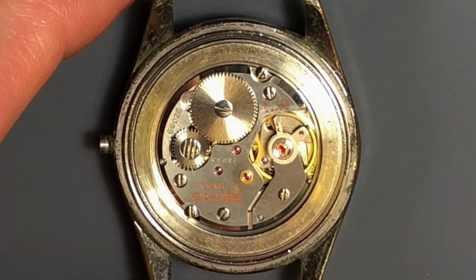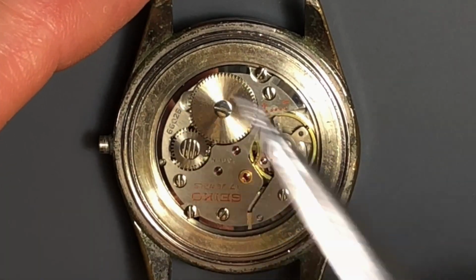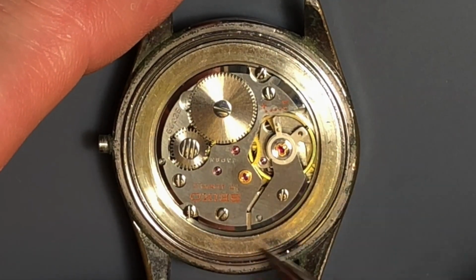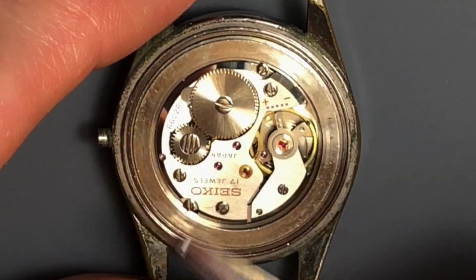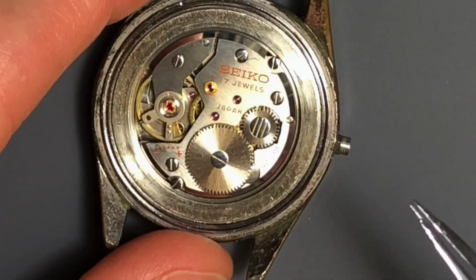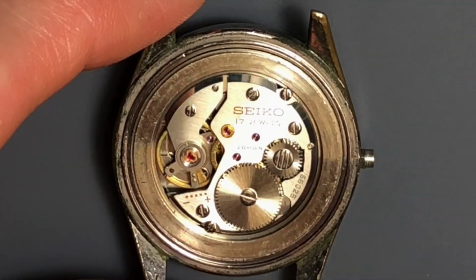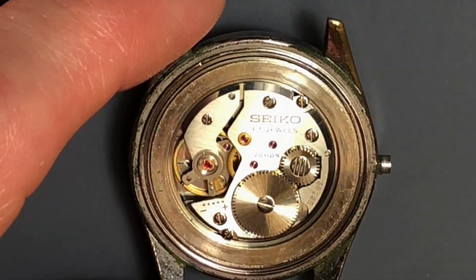And in fact, if you checked out the last watches that we had on offer, I had a little gold salesman sample tank that was sort of the base movement of this one, a 66. And the 02 is what qualifies this one as being different from that one, as the 02 designates that it has a date function. So yes, it's a kind of a smaller movement. You've got this nice wide movement ring here to sort of keep everything in place. I think this watch is around 36 millimeters, but still, for just this being entry level, Seiko did such a great job of, here, let's turn this right side up here. Did a great job of finishing these movements. They're not obviously anything ostentatious, or I wouldn't call this a beautifully finished watch, but for its purposes, they certainly could have left it without a lot of this finished work that most people are never going to see anyway.